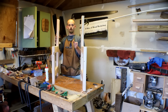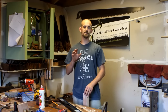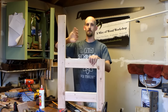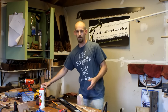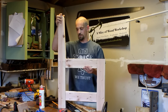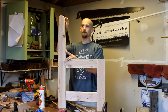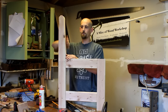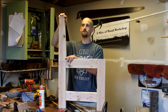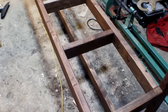Now what we'll have to do is cut the cross braces that go from each side. I have a slight design change — I was originally going to keep everything square on the back side, but after looking at it and sitting on the edge a little bit, it's going to be a little bit uncomfortable. So I came up with this slanted back. It starts at three inches up from where the base of the seat is and it's going to get an inch cut off at the top. I made that little angle and then on the bandsaw I also cut this curve out and took it to a sanding disc to get the rest of the circle shape.